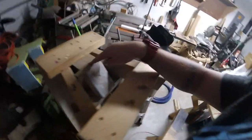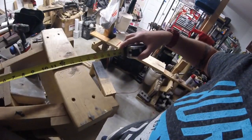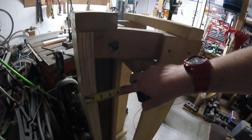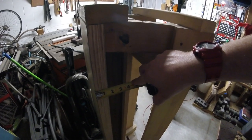Now on this it's simply a larger version. I've got a 1x6 down here at the bottom. This middle part here that goes all the way through is a 4x4, and then I've got just 2x4 caps on the side. Overall, the height of this is looking at about 16 inches. With the legs all the way down at the bottom you're looking at 15. I did decide to double up on the top, so that actually comes to just shy of 1 3/8 inches.